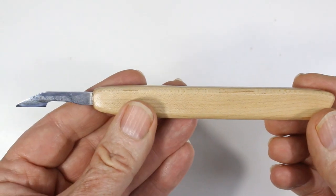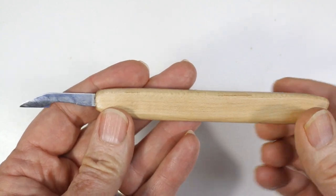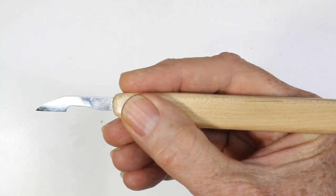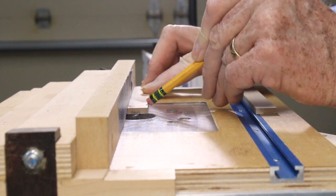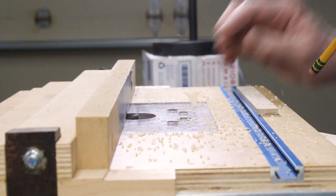I made a fairly thin, straight handle, which is a good shape for very small or delicate knives, because one option for intricate cuts is to hold the knife like a pencil. I will make a more elaborate handle for the second knife in the next video. I cut 2 strips of hardwood about 5/8 inch wide and about 3/16 inch thick and about 6 inches long.